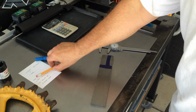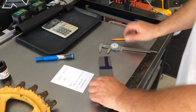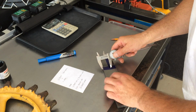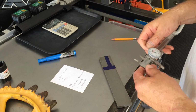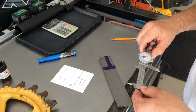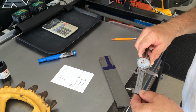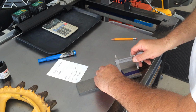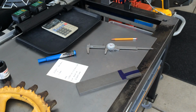Okay, our chunk of bar stock needs to be 2.820 thousandths and 1.200. So, got our marks, a little Sharpie mark on there. And let's mark it up. And then 2.820, 2 inches, 820 thou. Right, over to the portaband saw.